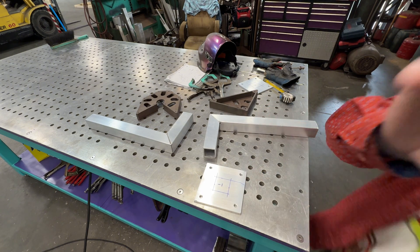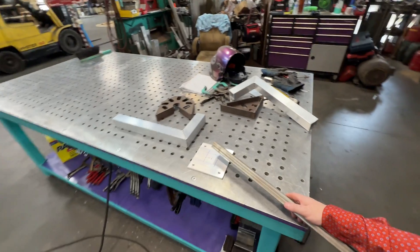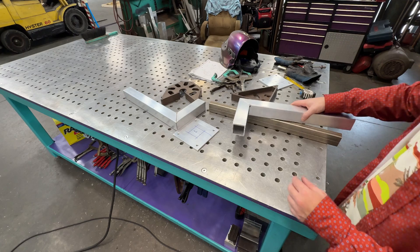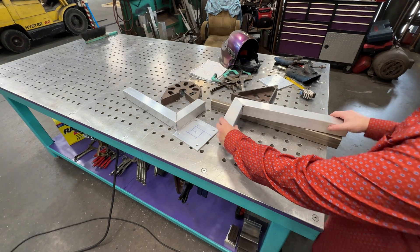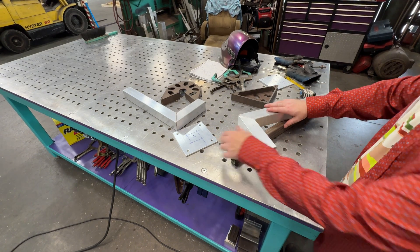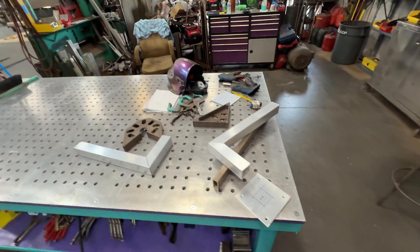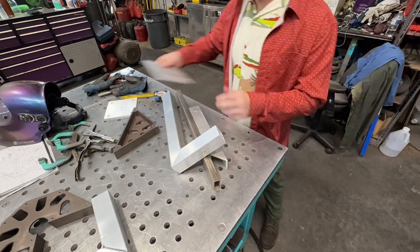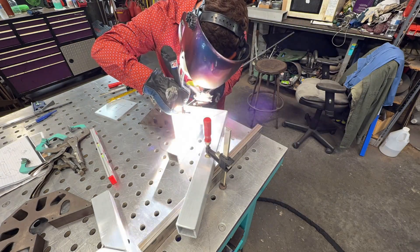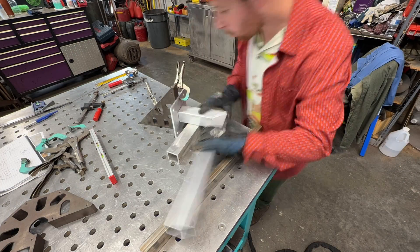That's why I like to save — I've got a little pile over there and I just save a bunch of little shims and stuff that I use — handy. Just going to time-lapse the fit-up. All right, pretty simple: grabbed another two-inch square tubing and used it so the piece didn't rock back and forth, clamped it down, used that fireball tool square, clamped the plate down, made it nice and centered, level, and square.